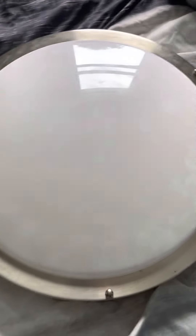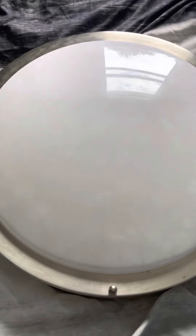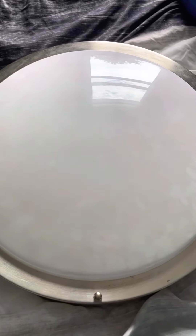Now you're going to take the thumb screws and screw them in place. As in the disassembly video, you're going to want someone holding the fixture while you secure the thumb screws. Actually, before you put on the plastic dome and ring, turn the power back on so that you know the bulbs work. If they don't, check the connections to make sure you didn't connect the cables to the wrong bulbs. If the light bulbs did turn on, you can go ahead and connect the plastic dome and the ring. Thanks for watching — I really hope you have a good day and I'll see you in the next video.